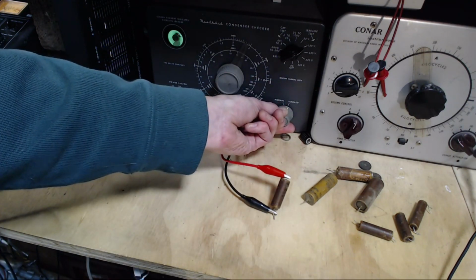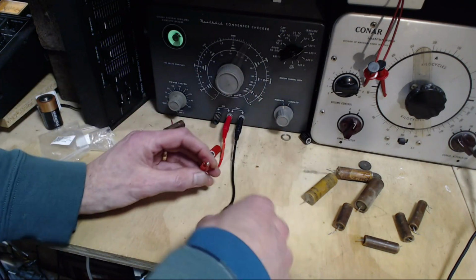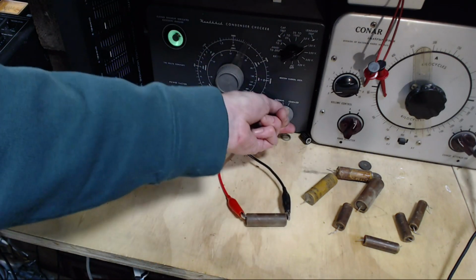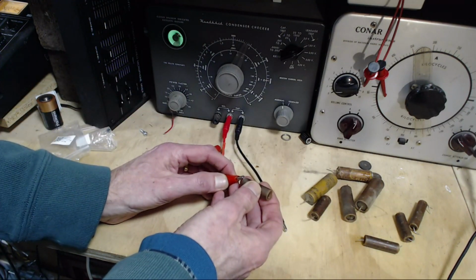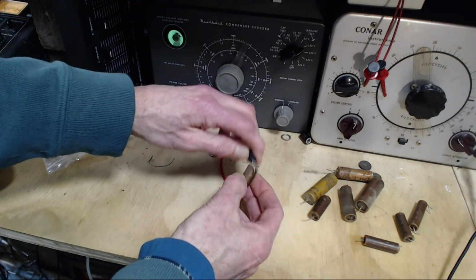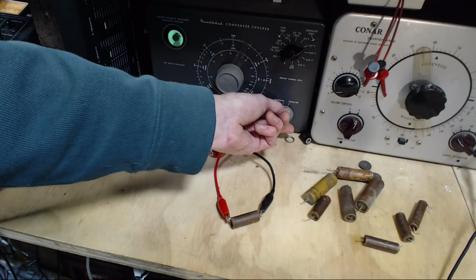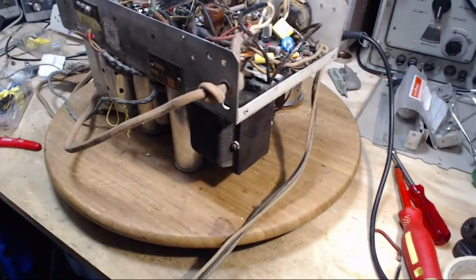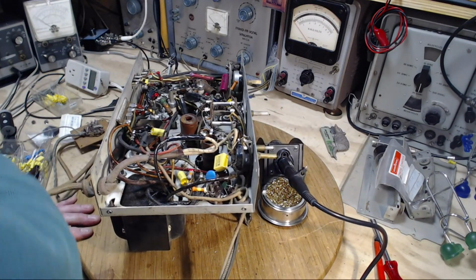Okay. These definitely are not. I mean, this is why this radio worked to some degree. But in terms of getting its performance way up with these old capacitors, it might be a bit of a challenge. That one's a little worse than the others, but there certainly is no terrible capacitor here. Well, that's it. So, all pretty consistent. I mean, they've all had the same life. They've been on the same life journey together. They're all very similar style of capacitor, so they've all gone the same way. So now in here, we're all set to go with turning this guy back on.